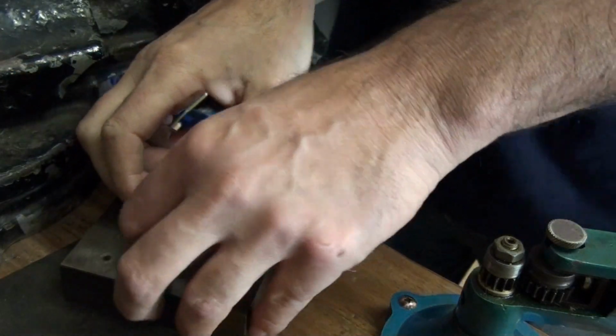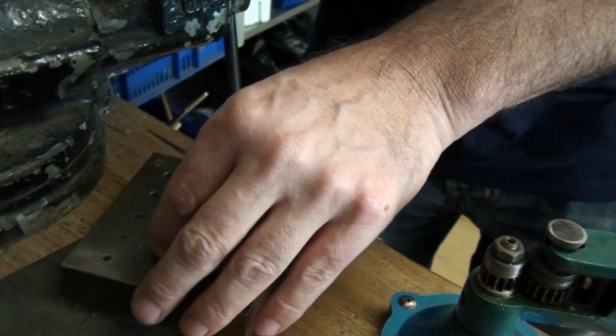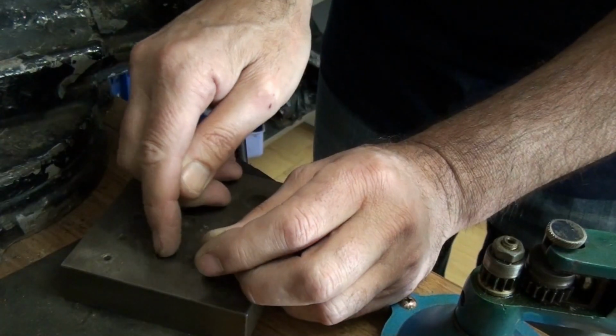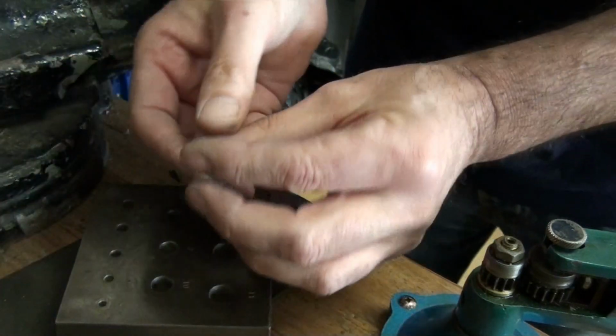As you can see, there was no punch used for doing that, although now I'm going to use the punch just to lever the setting out. I know, just managed to get it. It's a good idea just to rub a little bit of wax or just spray a bit of WD-40 onto your setting block, because the settings can get stuck.